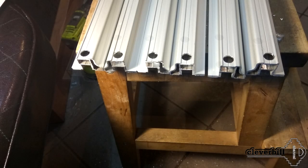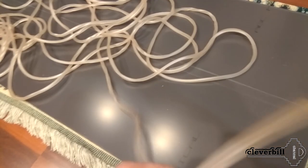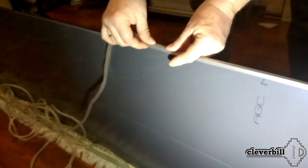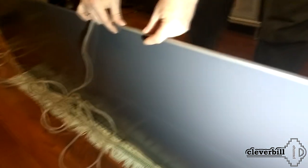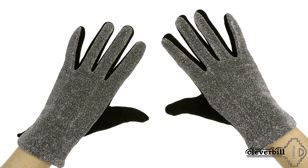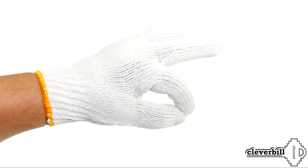After manufacturing the parts of the frame door body and inserts — in my case, glass and mirror — you can start assembling the door. For the silicone glass seal, it is necessary to put a silicone seal along the entire perimeter of the glass. It is most convenient to do this when the glass is placed on its edge; do not forget to lay something soft under the edge of the glass. Join the seal at the corners, preferably at 45 degrees, using scissors. When working with glass or a mirror, be careful and work with gloves. To protect from sharp pieces when glass or a mirror is broken during further use, use special protective films for mirrors.